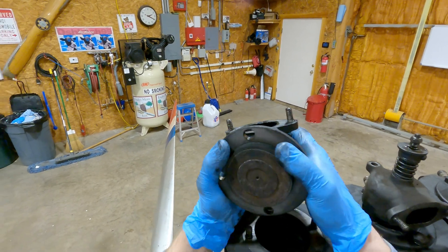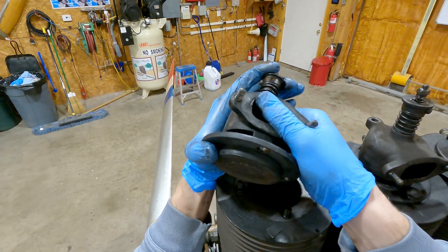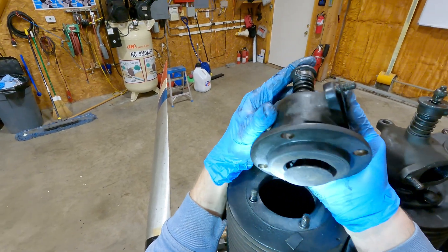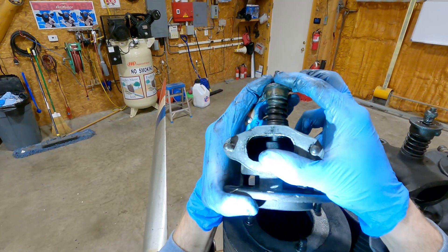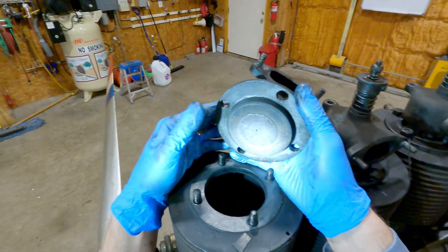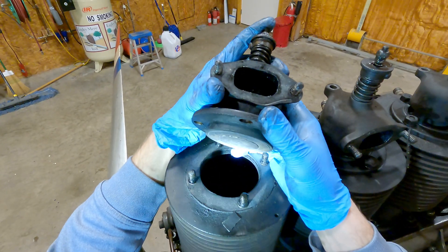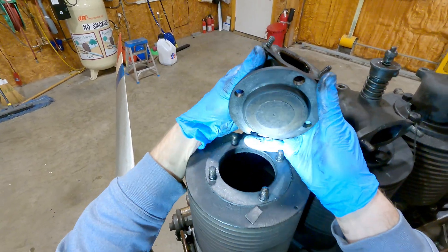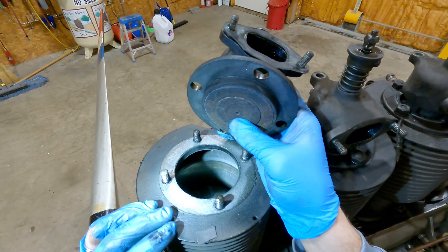It's almost like a sleeve setup — here's the exhaust valve opening, extremely cool. The exhaust fires, the piston falls, and your intake looks a lot like a conventional valve. When the rocker moves, it drives the exhaust. Four-stroke engines don't actually need cam actuation of the intake valve — it happens naturally. For more high-performance applications you need to move the intake valve in a more controlled manner, but they'll run with just vacuum and a fairly light spring. When compression comes up it blows the valve shut and holds it shut. This is a good cylinder — now we're going to pull off the one with the bad head gasket.